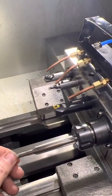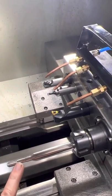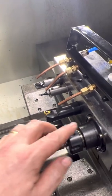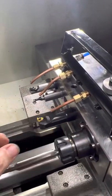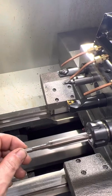So the pilots enter and exit the bore without deflecting. I place a test indicator right on the back side of the pilot in line with this adjustment screw, and then again on the back side here in line with this one, and then I adjust the screws to tighten and loosen as needed to make it so the pilot enters and exits without deflecting.